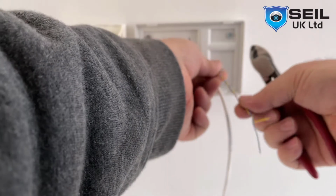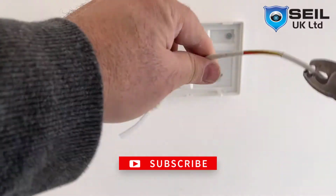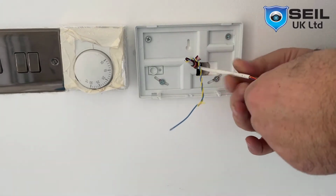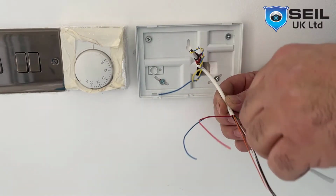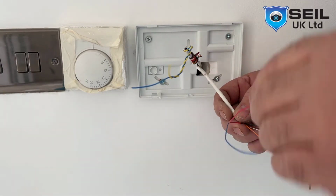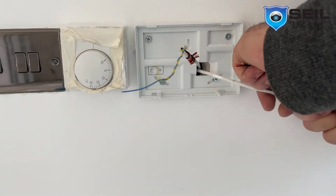On this keypad, we can use two sensors. And this is my keypad cable, the main cable coming from the panel. I use only power: black, blue, yellow, and black cable. So black and this one we use as power, and these we use as data cable. Then we only use four cores, and the rest are spare.